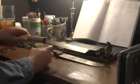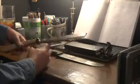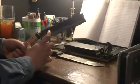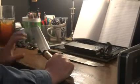The Japanese blade is balanced further forward, about right there. But what's even more dramatic is you can grab the Japanese knife right back by the end of the handle. Now all of a sudden the balance point is jammed extremely far in front of your hand. So what that means is you work with the blade up like this, it's relatively neutral in hand. You work with the blade back here, and all of a sudden you've got something that feels very much like a hatchet. You've got a lot of weight forward, it becomes a very powerful chopper.